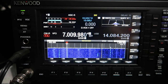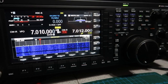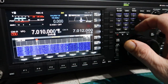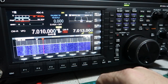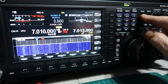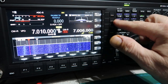If I was tuned into a CW signal and wanted to call him up two, the easiest way is to press and hold the split key and press two for two kilocycles up. If I wanted three, press and hold split and press three. For a negative offset, press and hold the split key and press zero first - so zero-two gives minus two split, zero-four gives minus four split.